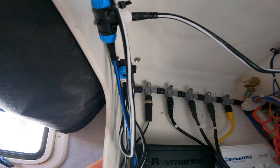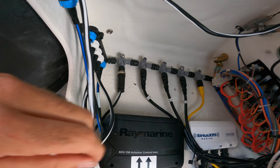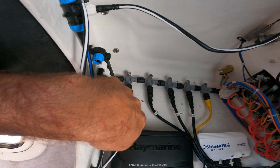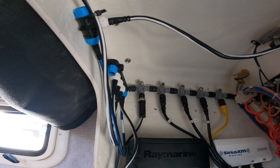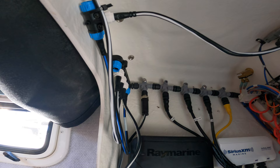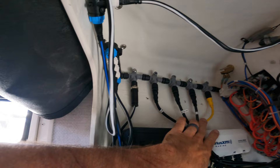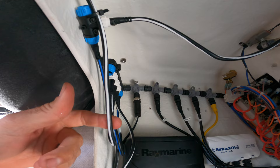The other thing that was a pain - I have my SeaTalkNG network up here, but because my Raymarine MFDs are all on the NMEA network, you have to have a bridge. This line right here is the DeviceNet or NMEA 2000 plug that has an adapter coming into the SeaTalkNG, so you basically have to bridge your SeaTalkNG to your NMEA 2000. Also - I talked to the tech - you don't need terminators in your SeaTalkNG network if you already have them in your NMEA network. If you do, it'll create a data loop. Also, you only want one power source - my NMEA 2000 is powered, so since they're bridged I don't need to power the SeaTalkNG separately.